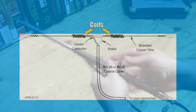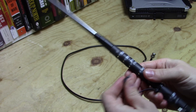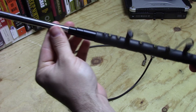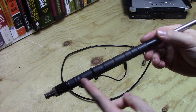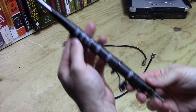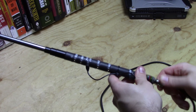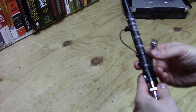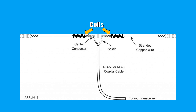In fact, there are a lot of companies that sell ultra-compact antennas that market exactly that capability — very thick coils combined with a very short telescopic whip. But as you will hear time and time again in the radio world, there are a lot of trade-offs with doing this. Generally speaking, the larger your coil is in proportion to the rest of the wire, the more inefficient the system is. So with a loaded coil system, there is a balance that must be maintained — having a whip that's the right length and a coil that's also the right size.